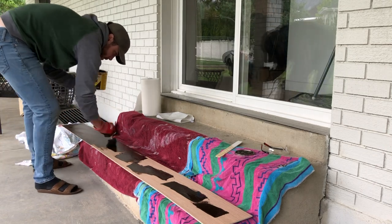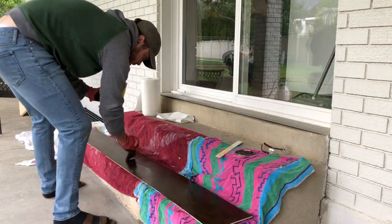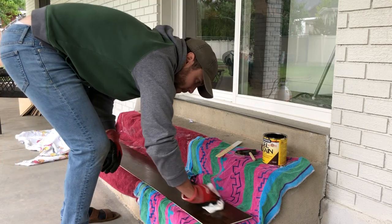As you can see here, all I did was apply some globs to the board and just used a foam brush to spread it evenly across the board. I will do a quick freeze frame here — you'll notice I'm wearing socks with sandals, which is critical to any project turning out well. But besides that, you'll also notice that I didn't apply any stain on the edges of the panels. Later on in the project, this becomes a bit of an issue as some of the unstained lighter wood becomes visible in some of the gaps between the panels, which I end up having to fix. So I would definitely recommend during this step, do some quick staining or painting on the edges as part of it.